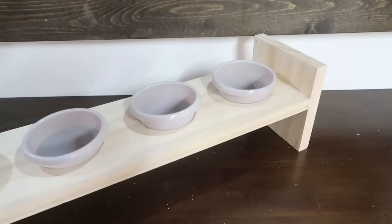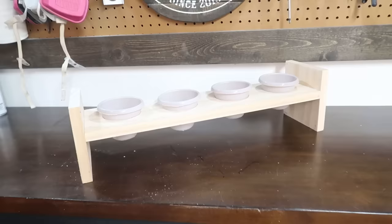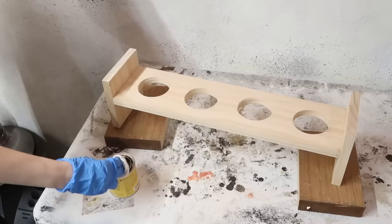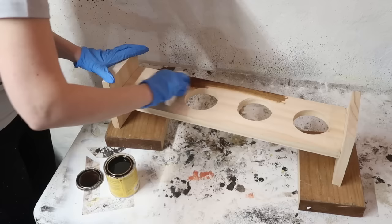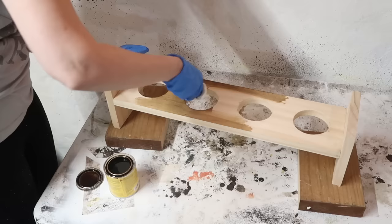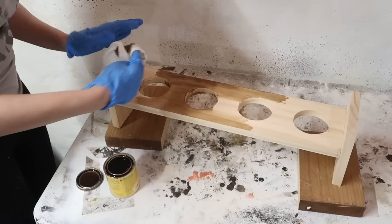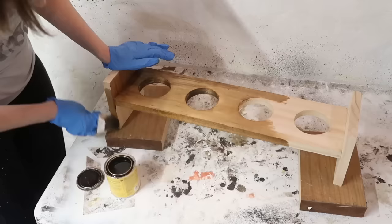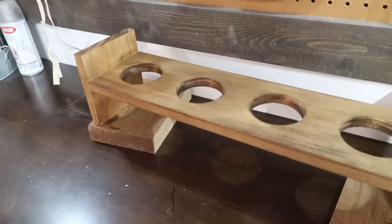If you're going to put it outside, you'll definitely want to seal it to protect that wood. I went ahead and stained mine — grab some nitrile gloves, you definitely want to protect your hands. I'm using Early American wood stain color by Minwax. The way I like to apply stain is with a flour sack towel — I get a big pack from Walmart for next to nothing, cut them apart, dip them into the stain directly, and just rub it onto the wood. It is so much quicker than painting, probably quicker than spray paint too. Let this sit and dry overnight and then it's good to go.